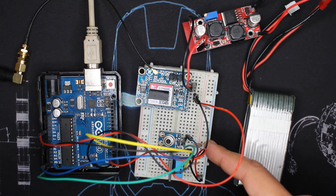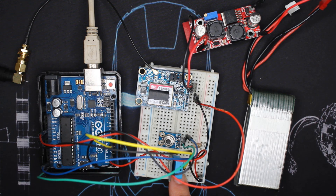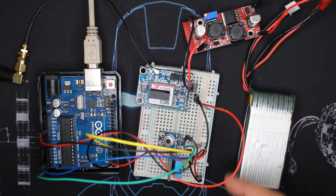The MLX sensor uses SDA and SCL, which means it uses the I2C interface with Arduino — it's already wired to A4 and A5. The DHT uses one wire only, wired with pin number 7, and both sensors are powered by the Arduino using 5V and ground. The first thing we'll see is just receiving a simple SMS and showing it on the serial monitor, so for the moment we won't need the DHT11 and MLX sensor, but we'll keep them wired.